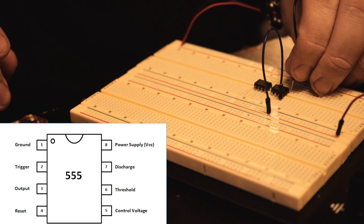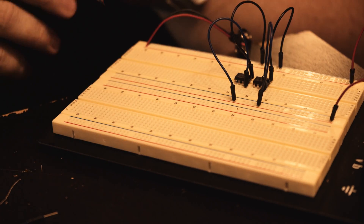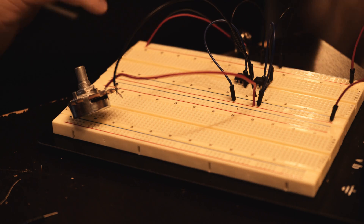On the other side at number one, I'm going to give that negative power. So now that the chip has power to it, we're going to add in the potentiometers. The original diagram is looking for a 500k potentiometer. I'm going to switch the one on the first chip to a 50k, and the one on the second to a 100k. So I'm going to add the 50k potentiometer to the 7th pin, and then the 100k potentiometer to the 7th pin on the second chip.